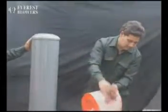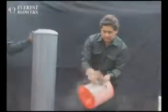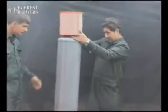Clean air filter every fortnight. A choked filter would result in excessive power consumption and overheating of the blower. Replace filter every 3 months or earlier. Check and clean air silencer every month.